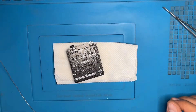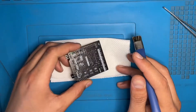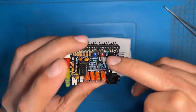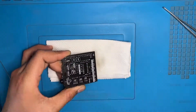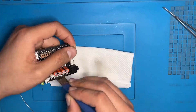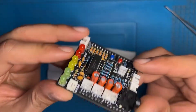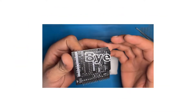Now I am taking a tissue paper so it will collect all the extra flux separated from the shield. I have taken IPA on a brush — stroke your brush in one direction only, don't go back and forth. You can see the extra flux here, caused by the soldering — it may vary depending on the soldering wire you are using. The extra flux is collected on the tissue paper and this also removes all the dust and other materials from your PCB, making it as clean as new. We have successfully completed our task of assembling the shield. Hope you found this video informative — if you like this video, do like, share, and subscribe and follow for more. Thank you, bye, peace!